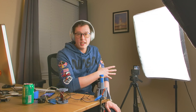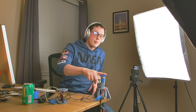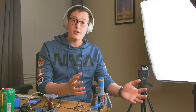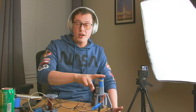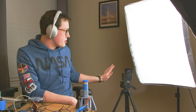The way this works is I've got a high-speed camera here — the Sony RX100 Mark IV. It's an excellent camera. It's a little expensive for a point-and-shoot, but it can do up to 1000 frames per second. We'll be filming at 1000 FPS to get a really good sense of how long this takes in super slow motion. Now the other way you could do this is by sticking an IMU, an inertial measurement unit, on the top or any part of the thrust vector control motor mount, and that would give you the actual data — so long as you were recording from the same data recording device. The camera has literally just shut down because it ran out of battery. It's a great camera, but the battery life is awful.